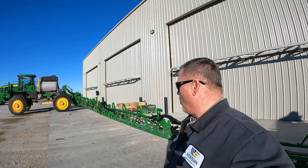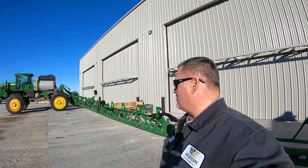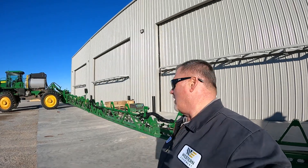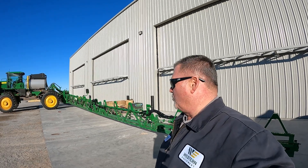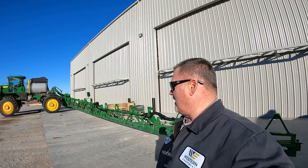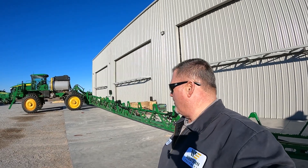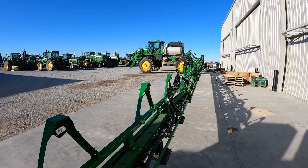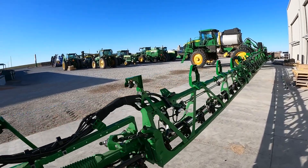It's also going to cut down on wear and tear on the sprayer, so it's going to be pretty interesting to see how See & Spray works. We're doing a little bit of calibrating this morning and calibrating cameras. We've run into a few issues with how one camera is sitting in relationship to another — that tolerance has to be relatively close from camera to camera. Basically we've got 36 cameras installed on the sprayer and we're running our calibration now.